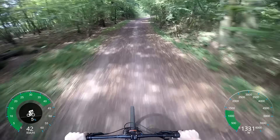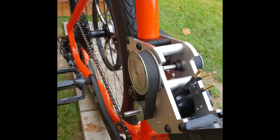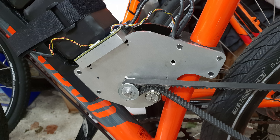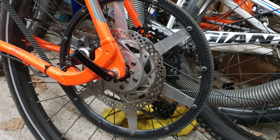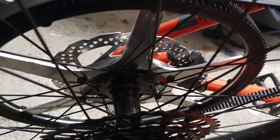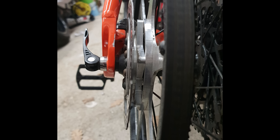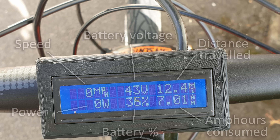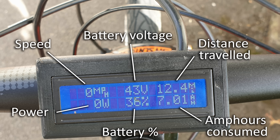But a lot has changed since then. The dual pulley setup produced a lot of noise and resistance which reduced efficiency and range, so I flipped the motor around and made a new mount connecting the motor output directly to the main drive belt, and completely redesigned the large rear pulley to be manufactured from a single piece of aluminium — removing the need for singular spokes — spaced away from the brake using a few aluminium discs. I also programmed an Arduino board to gather serial data from the speed controller and display all the important information on an LCD screen. If you own a VESC6 and want to make a similar display, I'll post a link in the description.